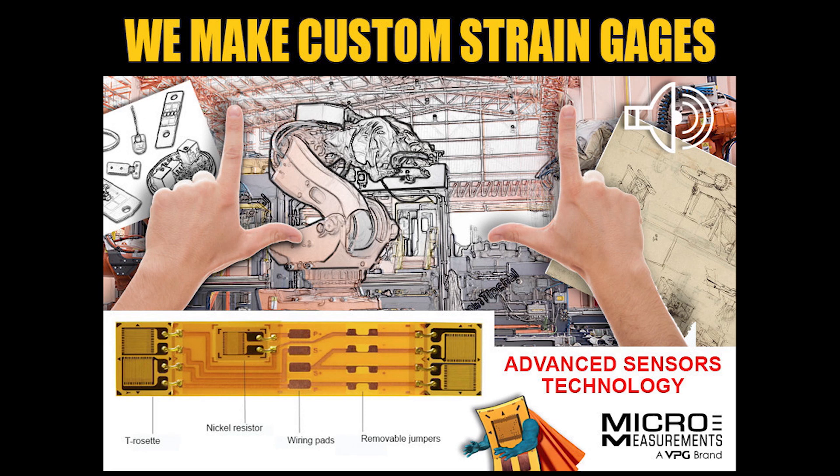Typically you've got somewhere in the neighborhood of six to eight weeks to take that, clean the part, put that gauge on, put pressure on it, and then elevate the temperature. What happens is that adhesive will reflow and it'll bond onto the part. So not only does it have the high resistance and the multi-grids on one backing and the flex circuit, it can also have an adhesive pre-applied. We really eliminate a lot of the potential sources of error as well as the labor for the gauge installation, making the design neat, clean, and hopefully very repeatable.